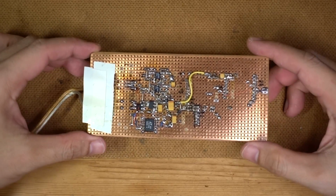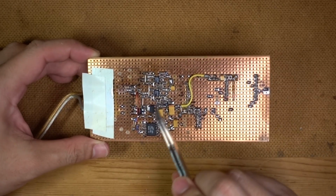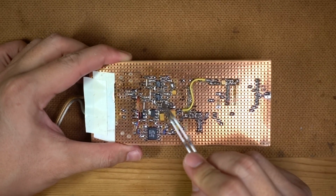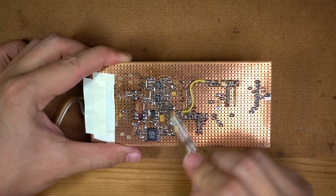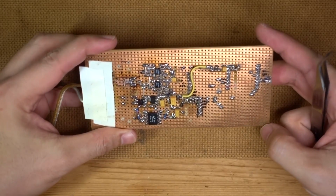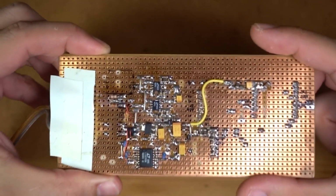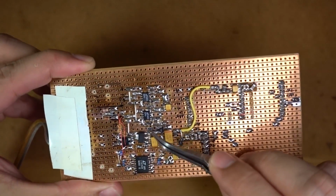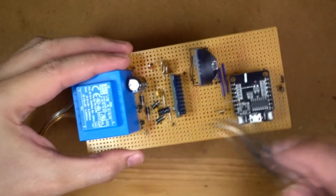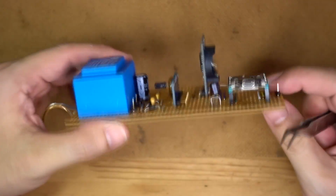Now you remember in our last video we put some additional capacitors, and you might not be able to see it quite as clearly, but they are here all over these power buses, all over the place. Really, I added a lot, and it turns out that it's really difficult to get rid of some of this noise. I put a whole string of caps here, and on this side I put big caps, small caps, electrolytic caps, polyester caps, all over the place.